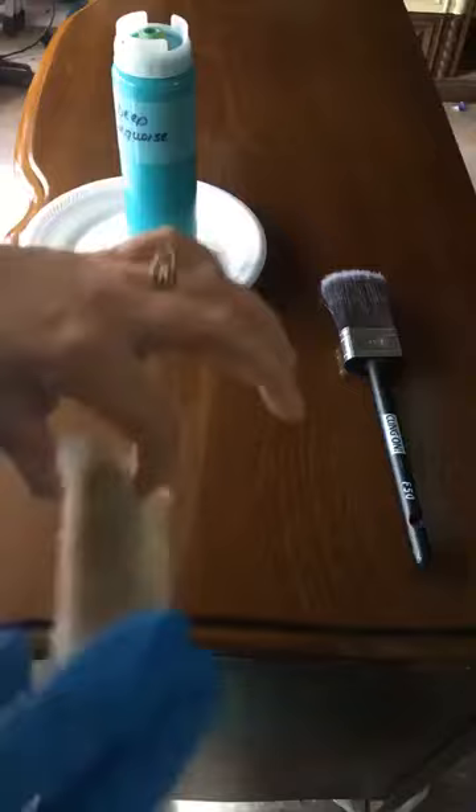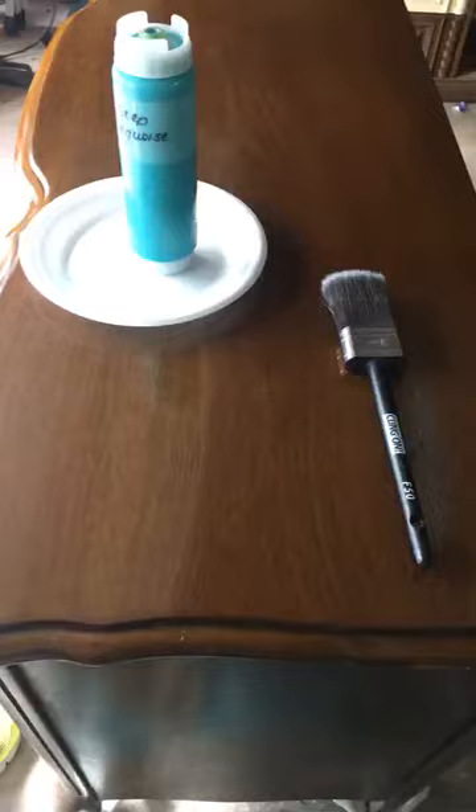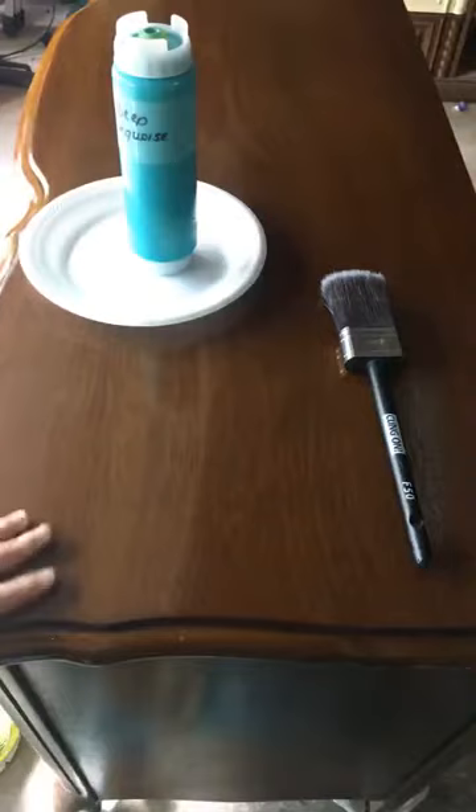To apply the deglosser, I use these scrubby pads. They've got all kinds of densities and thicknesses at Lowe's. You can go on Amazon, Walmart, wherever. I just kind of scrub it in there and then go to the next spot, scrub it in, next spot, scrub it in. Then once it's all gotten relatively dry, I come back with my vinegar and water and my rag and clean that all up. Let it dry really, really well before sanding and then adding the shellac.